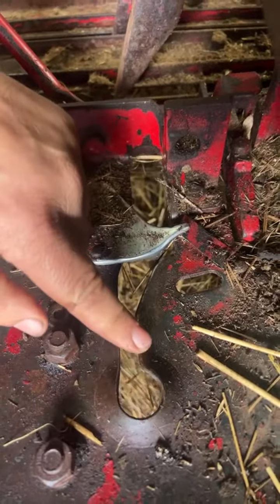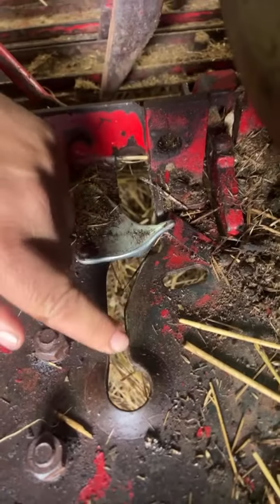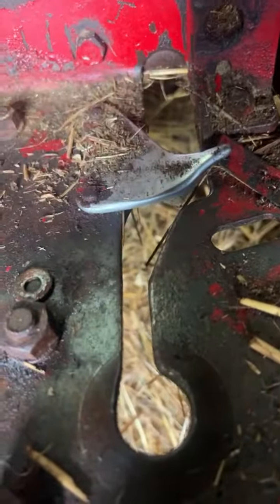So this from here all the way back — all this in here has to be shined up — because this is what actually pulls the knot off when the bale comes back. But this baler, as you can see, is pretty shiny; it doesn't need that done. But any balers that have been sitting outside or been sitting a while, you've got to sand that until it's super smooth.